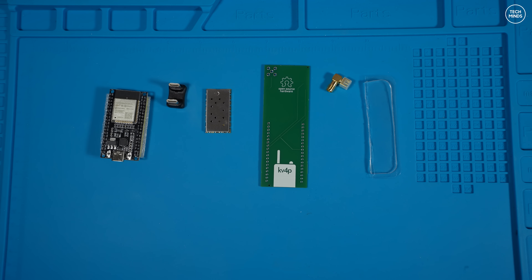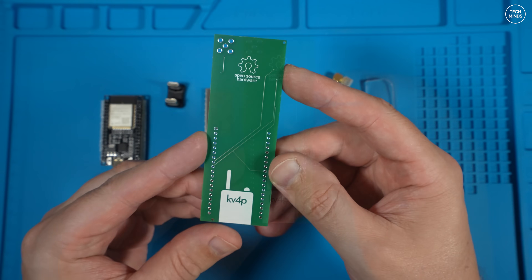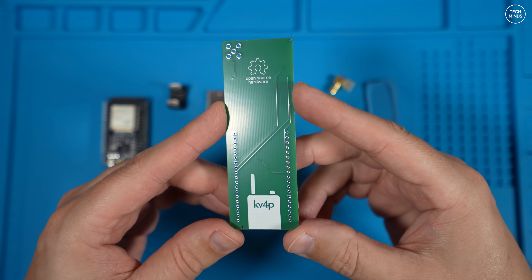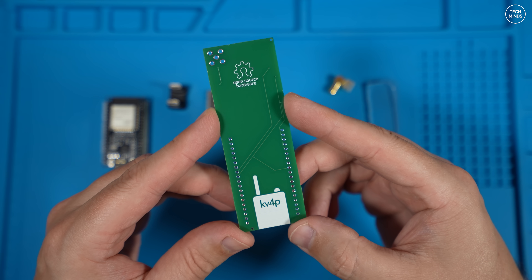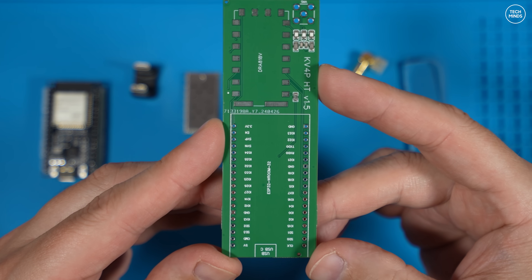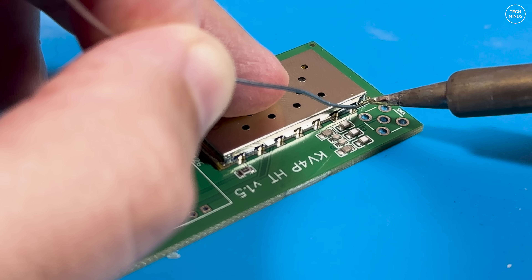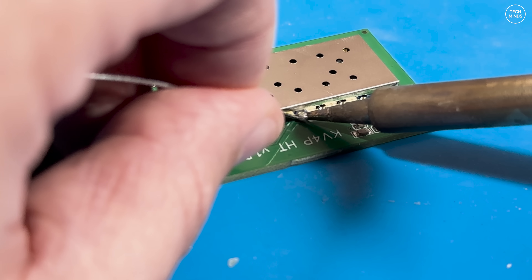I have here all the parts needed. The board I have is actually version 1.5, and the latest at the time of making this video is version 1.7b — the improvements made to 1.7b are the filtering. I do have a 1.7b PCB on order from JLCPCB and I'll make another video when that arrives, but for now I'll build this version. The small SMD filter components are already fitted to this board, so I just need to fit the radio board, the ESP32 development board, and the SMA socket. With these types of radio boards I like to solder one connector first just to make sure all the other connectors are aligning with the PCB pads. Once you're happy with the orientation, just solder the rest of those connections.